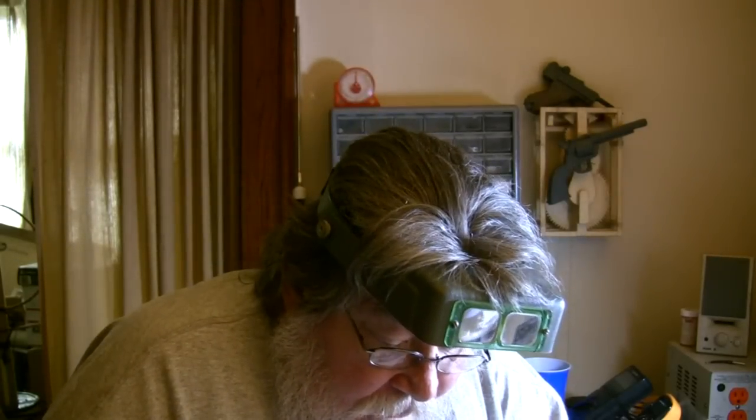Now, I thought, well, maybe because it's at the end, and this has automatic gain control, something's messing up. Maybe there's a short that I haven't found yet. Maybe it's kicking back, and the automatic gain control is knocking this out. So I shorted that. You can jump from R38 to test point 3, and that will knock out the automatic gain control, so nothing goes back knocking that down. You should have full power no matter what. And that didn't help.